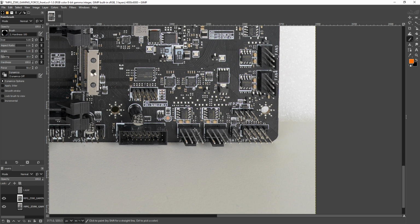Not reliably anyway. I mean, technically the Gigabyte BIOS does have a recovery message that I've managed to trigger a few times, but the problem is it's unreliable. So a lot of the time you just end up having to hit the clear CMOS button, and the same is true of Asus motherboards.